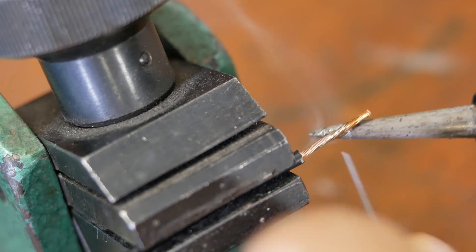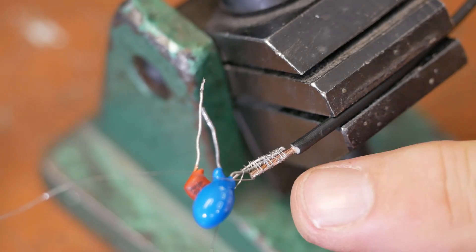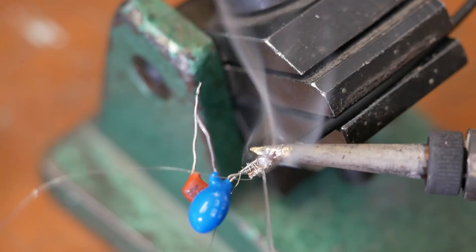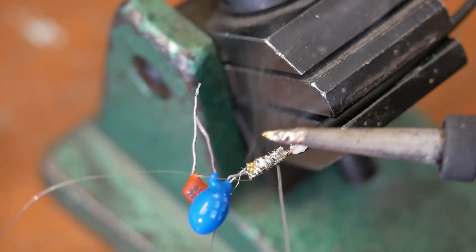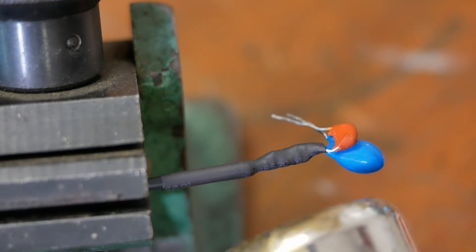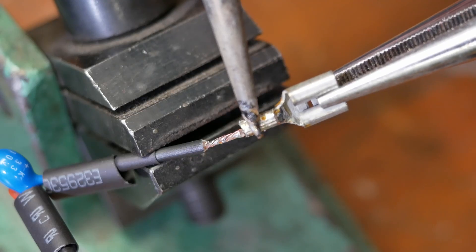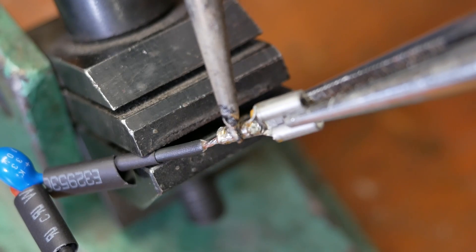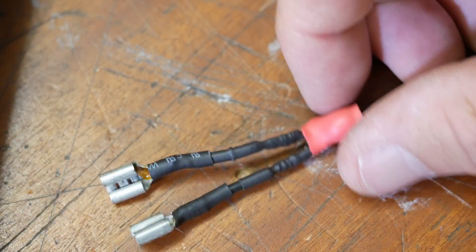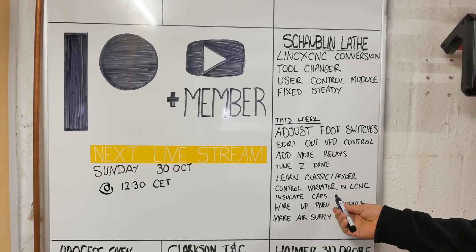Turn up the end of one. It's really not that easy to solder three things together like this, so I just bound the areas to be soldered together with a single strand of wire. I threw a bit of heat shrink over the end, more just for mechanical support than anything. Hopefully no more shorts. That's the first job done.